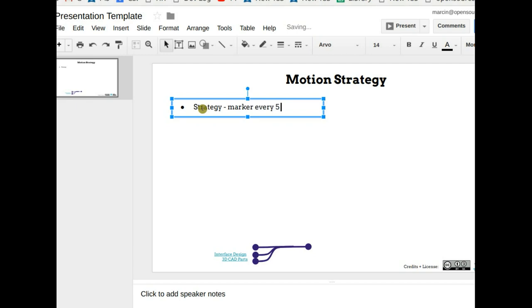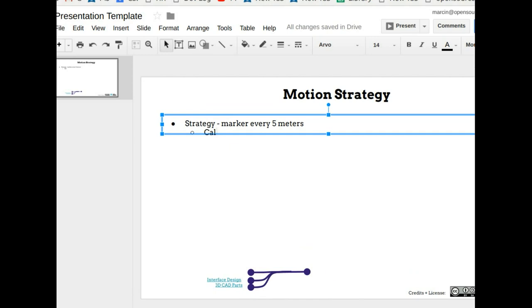We would have a calibration pole or a calibration marker at the beginning of the field, which the tractor can look at and then calibrate itself based on it, so that it knows the height and the diameter of the pole, and then it can see it in perspective and adjust itself to it, and make sure that it is doing the mapping in the right way.